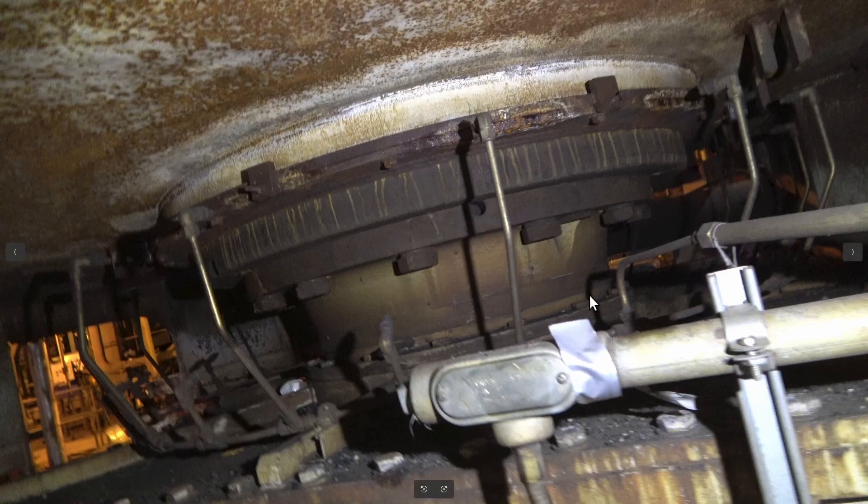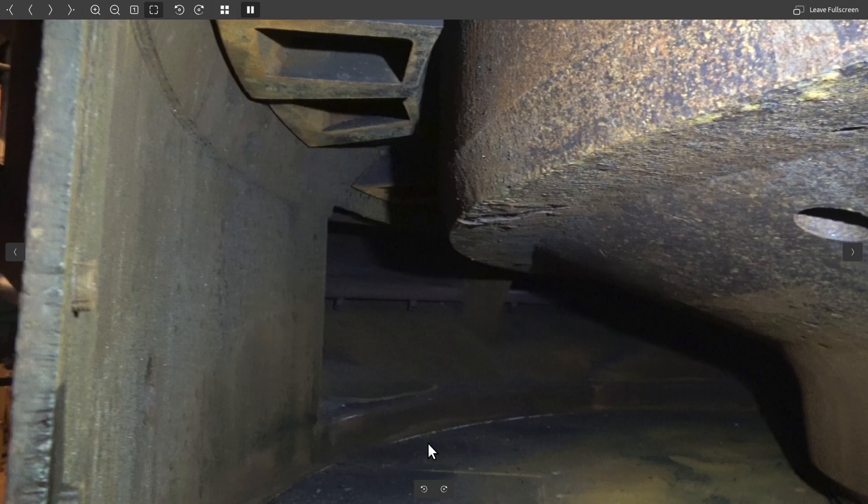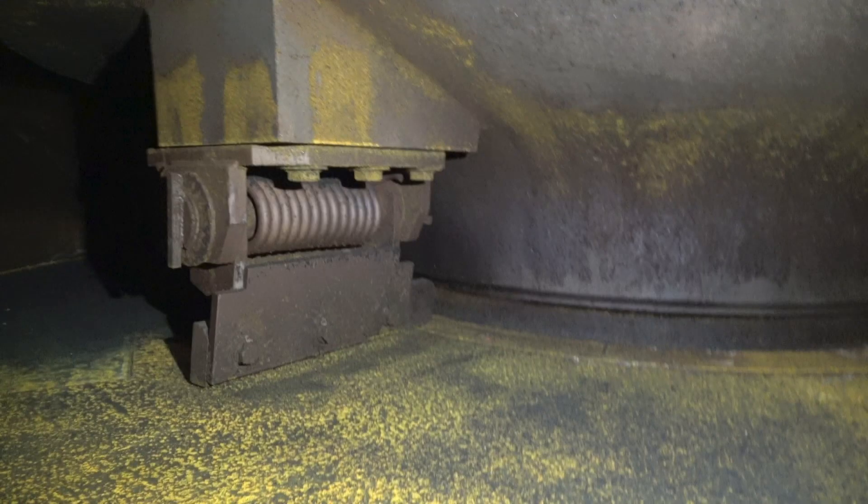Another picture down below — the turntable sits right above here, and each of the sprays is for grinding out. This is the air box; this is where the air is coming in. This is the sweeping steam — these little nozzles blow out any coal that builds up, as it sometimes gets thrown back up in here. These are the air ducts going up to the grinding table. You can see a little coal and stuff that gets kicked back down and drops down. So these will drop ungrindable material and even some coal down here, and the scrapers come along and move all that debris down to the pyrite inlet chute. They're spring operated.